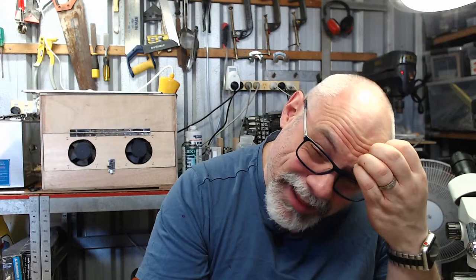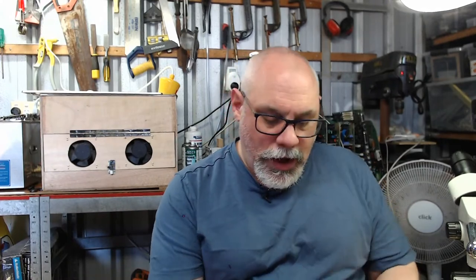It's my understanding that the computers will work when they kickstart them. That's basically referred to when the Macintosh 2, 2X, 2FX, Macintosh 2 series, ultimately, they start by pressing a key on the keyboard. They don't start by a switch on the back. So that's like, you know, that soft boot type thing. In order for that to work, there's a thing called the startup circuit. And you can bypass that startup circuit. So in other words, just kind of force the computer to switch on even without pressing the power button on the keyboard. And it's my understanding that he has been able to get these working that way, but he can't get them to work when pressing the power button. And it's a very, very common problem because of where the Mac 2s get damaged.